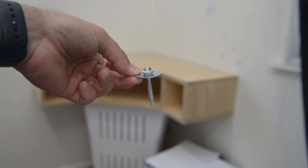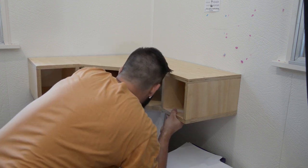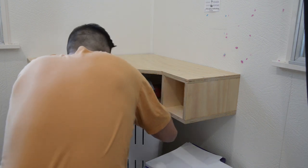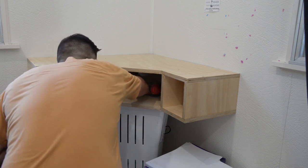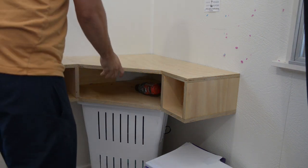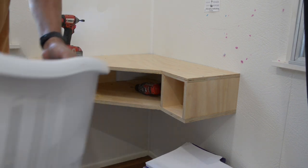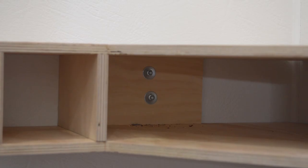As I said earlier, I'm using a roofing screw and a large washer to fix it to the wall — make sure you screw into a stud. These screws have a self-drilling head which means in most cases you can drill straight into anything without too much trouble. But in my house all the studs are Australian hardwood, and if you know much about Australian hardwoods they're like drilling into rock, so I pre-drilled mine and drove the screws in all the way making sure the table was level as I went. I used four screws in total, which is plenty strong, and since I used a large washer that gave me a lot of surface to bite on.